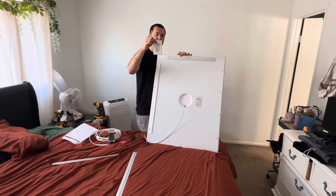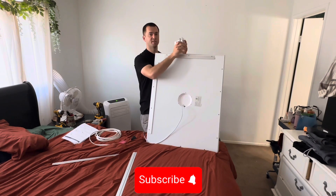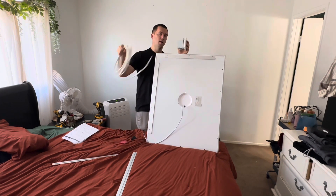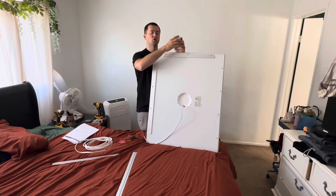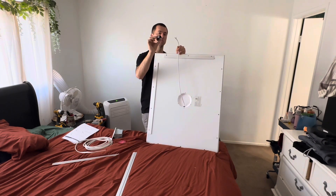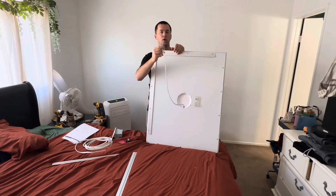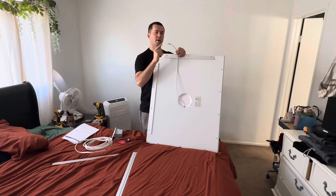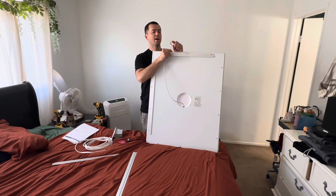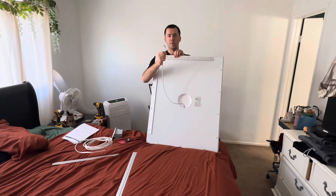It does have this indent for the cord and for the plug. I'm going to be installing it with this recessed outlet that I bought — it does not come with this — and this is going to go inside the receptacle box. Once that's installed, make sure you have some wiring as well. You can install this a couple different ways. I'm going to be installing it with this plug, adding the plug to the end and plugging it into the outlet I'll be adding. You can also hardwire this directly into the wiring as well. There is a neutral, hot, and a ground wire on this; as long as it's plugged into a 110 volt outlet or 110 volt wiring, you are good to go.